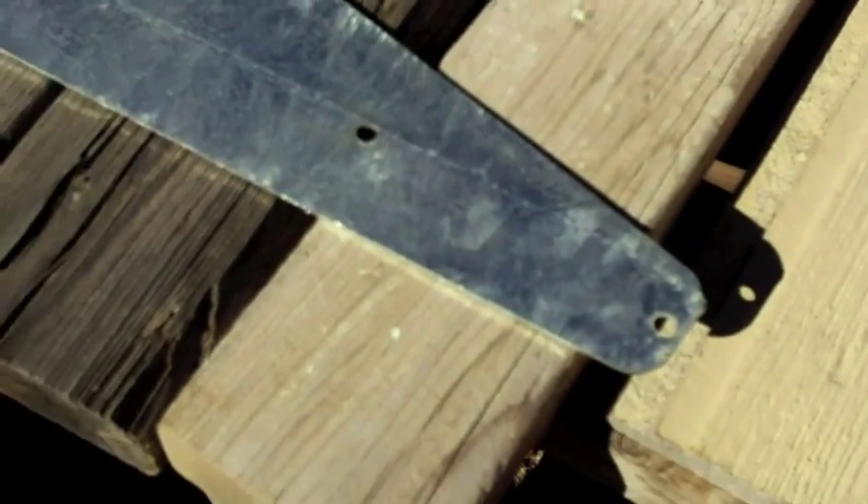I'm afraid that all these rough marks are going to catch and hold moisture. It's not very smooth, and if it holds moisture it will start to rust. There are some more rough spots right here, big gobs of galvanizing, and on the edge there's a big chunk of galvanizing - I don't know if that would create rusting problems, but it probably will. Even though it's galvanized, it will rust if the coating is compromised.